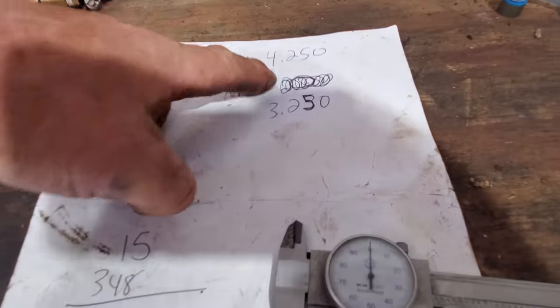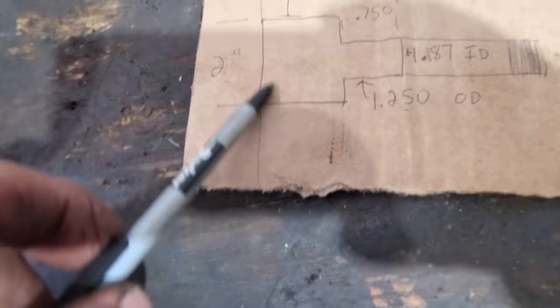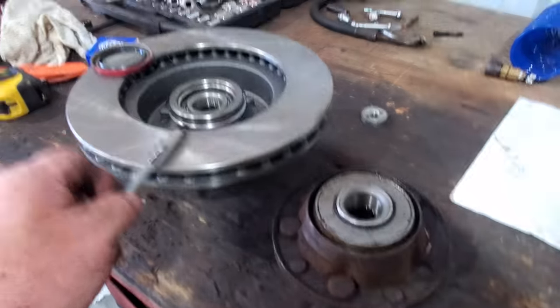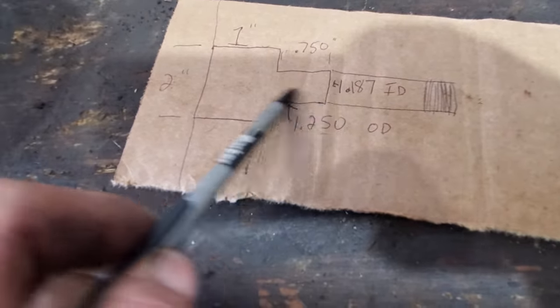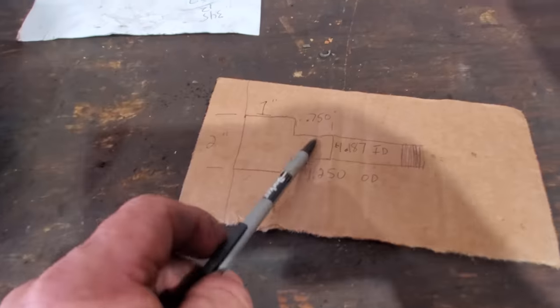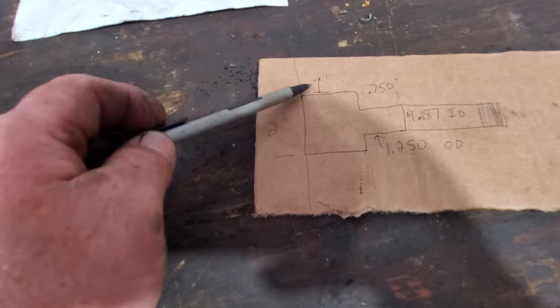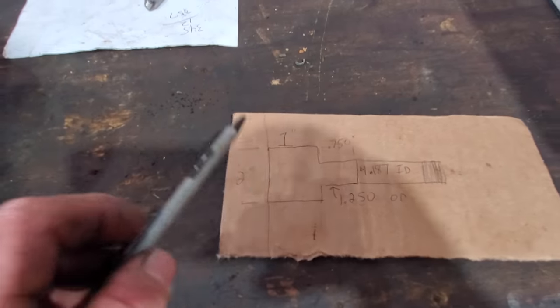What I got was basically an inch difference. Here is this area right here — that's my adapter, and I know that's got to be an inch. The spindle is an inch and 187, so that's the ID all the way through. The new bearing is an inch and a quarter, so that's the OD. This three-quarter length here is about 650 or so; I decided to go with 750 because it's a good round measurement. The seal is an inch and 150, but I remember seeing two inches when you look this seal up — so we'll go two inches so the seal has something to ride on.